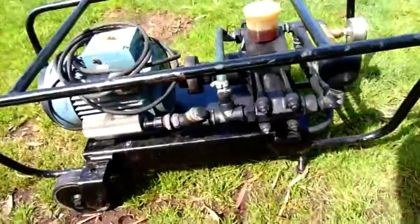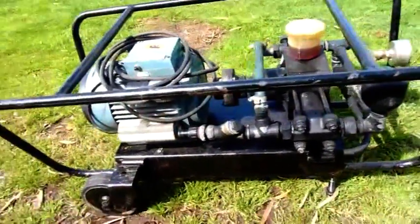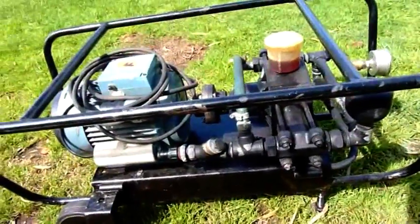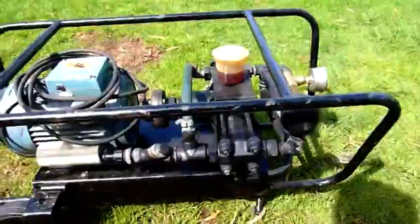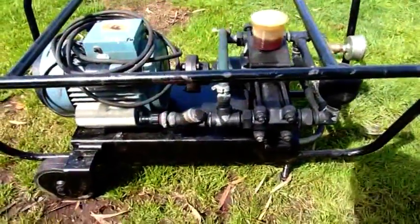I reckon we'd have rust scale and stuff plugging that bloody inline strainer. If we're not getting enough water in through the intakes — this is a common intake manifold going to both cylinders — if it can't supply full water flow through that little inlet, it's not going to work. This thing actually needs full volume, not so much pressure, but just good volume. And it won't get that if this strainer is plugged. So let's pull that apart and have a look.